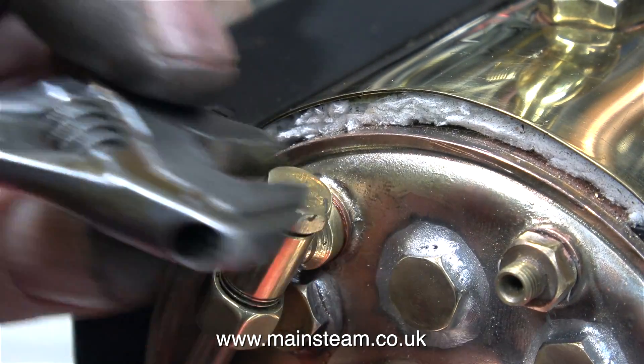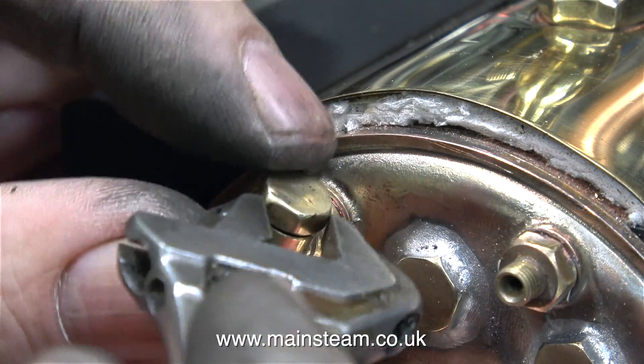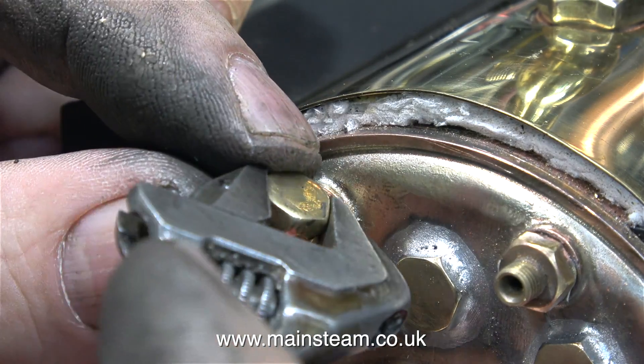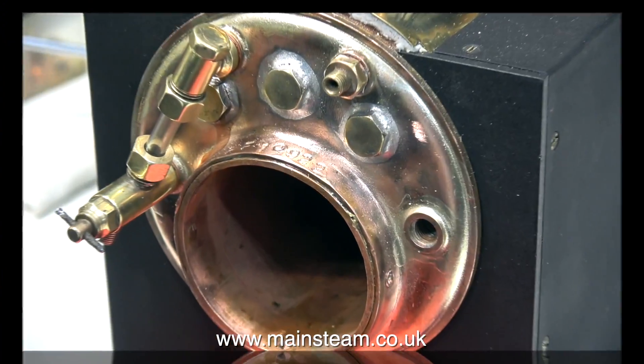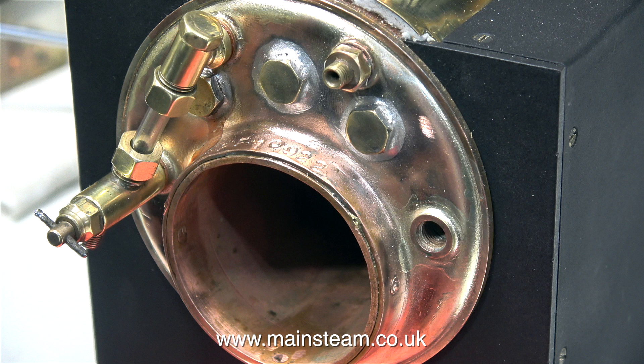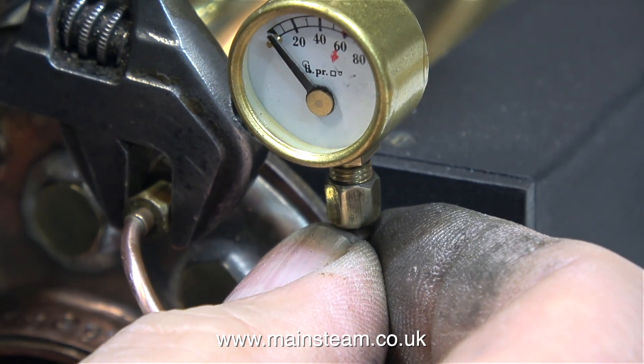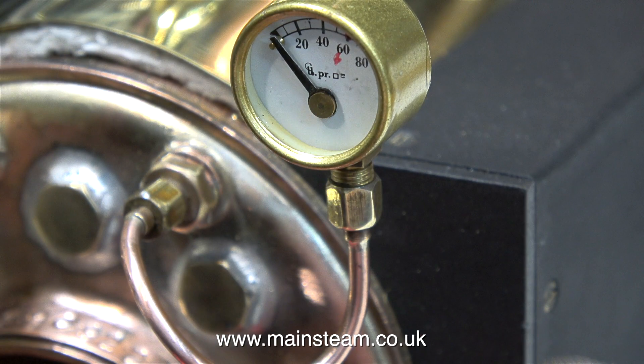It's not like a thermonuclear explosion — there's just a bit of a loud crack, and a lot of steam and water comes out of the gauge. It's only really a problem with a coal-fired boiler, but with a gas-fired boiler you can turn off the gas. So here's the job so far, and the next part to fit is the pressure gauge. When you put in for a boiler certificate and you steam test the boiler, you're supposed to remove the cover from the pressure gauge and mark the working pressure with a red pen. The working pressure of this boiler is 60 pounds per square inch.